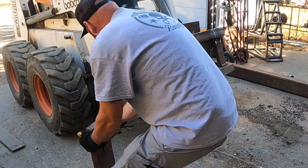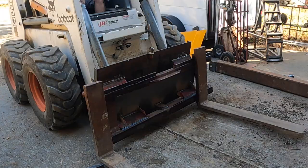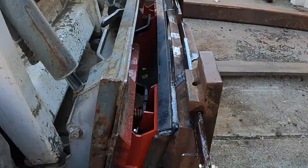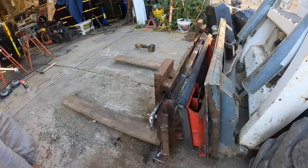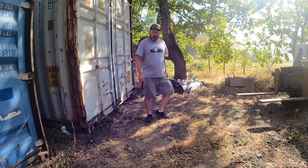Now I'm removing the lock pins on those forks because there are actually no detents for them to go into, so they just add one more level of hassle. This is not the smoothest working rack in the world by any means. There was no way of locking the forks on there, so I went ahead and drilled holes in the corner so we can just run a bolt in — that way the fork can't slide off the side. Those are just three-eighths grade eight bolts. The forks do not slide easily at all, so moving them is a complete pain and usually includes using a hammer.